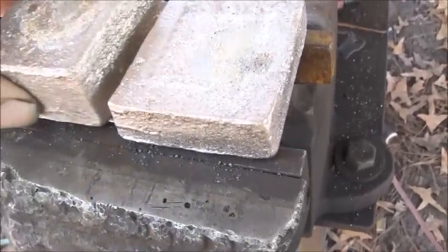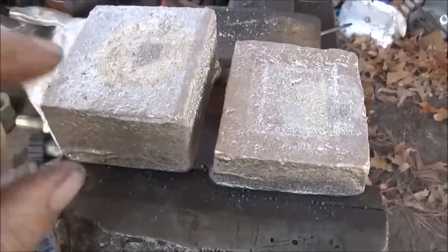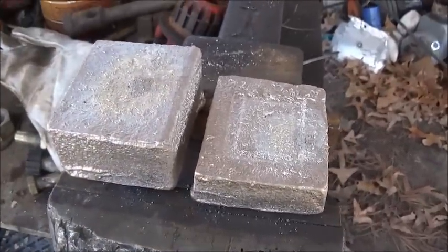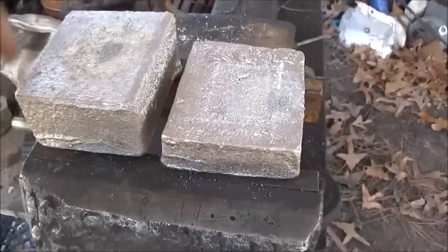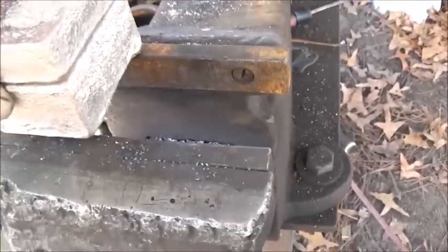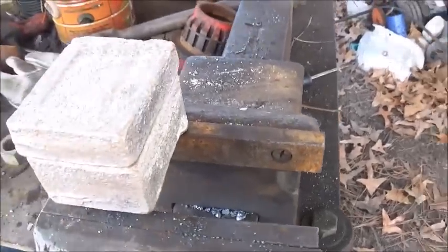on the sides, nothing major, and then we'll have to machine top and bottom, because it's gonna be thinner in this course, and then machine our hole out of the center, and we'll drill it out and machine it out, and then we'll try to get the corners sharp like we need them. This will eventually bolt on top of that. That's the plan. All right, let's get to machining.